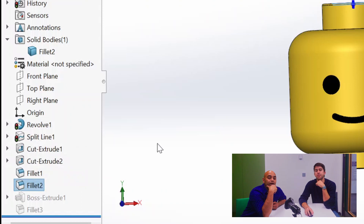Something else I want to mention: put fillets right at the end. I've seen a lot of people create a feature, fillet it, then create another feature and fillet that too. That can cause problems down the line, because you might reference the fillet edge, and that can cause issues — you lose the edge when you fillet it. It's the same thing as manufacturing: when you're doing a deburring operation, you do it at the end of the process. Hence, fillets are meant to be at the end. Lesson one: think about the manufacturing process. CAD is never away from manufacturing.